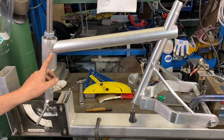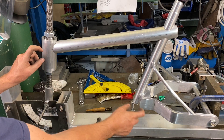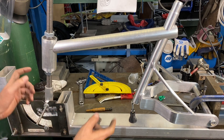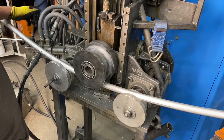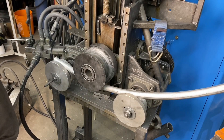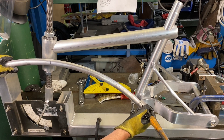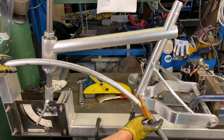Now I'm going to cope the reinforcing bars and make them a little rounded so it looks more appealing. The way I'm going to do that is roll-form them in an arc on my roll-forming machine, then fit them in, cope them, dry-fit it, and tack and start getting it welded. I want it somewhere around here — let's bring it down a bit more, something like this, just to get the idea of how much I need. Yeah, that looks nice.